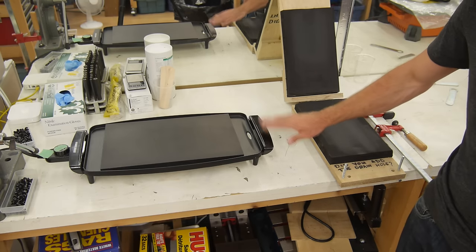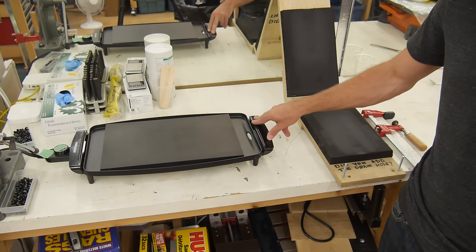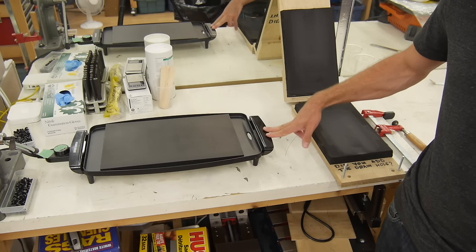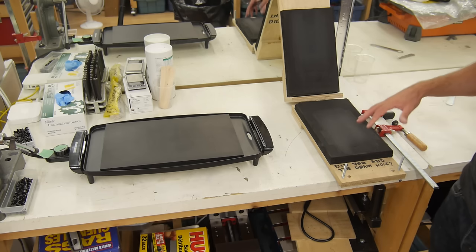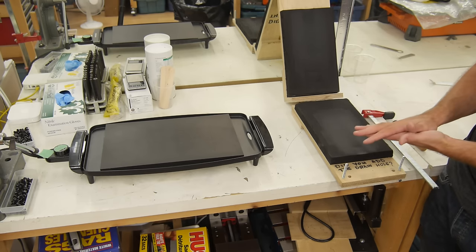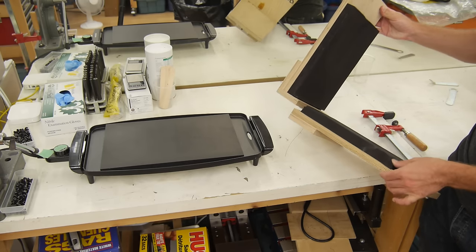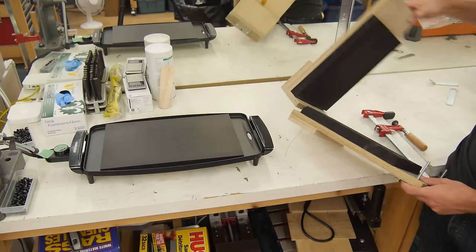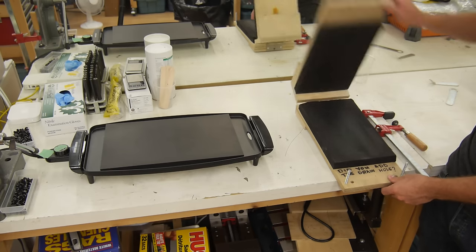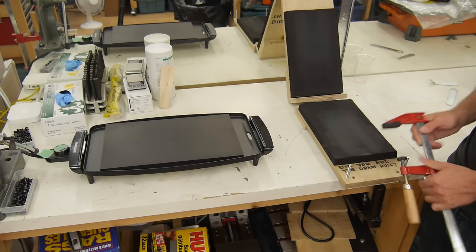You're also going to need a method for heating up your Kydex. This is just a small electric hot plate — a griddle. It works very well and I highly recommend buying one if you're going to do any number of Kydex sheaths. Once the Kydex is hot, you're going to use what's called a Kydex press to press the hot Kydex onto the blade in order to make your sheath. A Kydex press is basically two pieces of very stiff heat-resistant foam inside a folding shell of some description — this one is just held closed with a clamp, a standard F clamp.